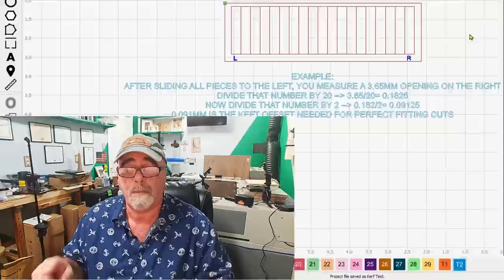Once I click OK, LightBurn saves it on the cut layer permanently. If you always use black to cut, do this on your black layer. Now the next thing to talk about is why this number would change — and there is a reason it would change over time. If you're a heavy user and you don't clean your lens and mirrors on a CO2 daily, this number might change slightly.